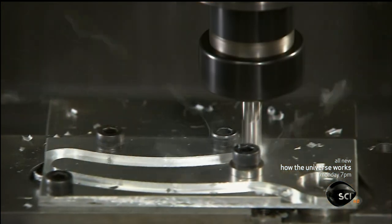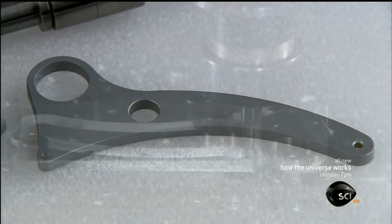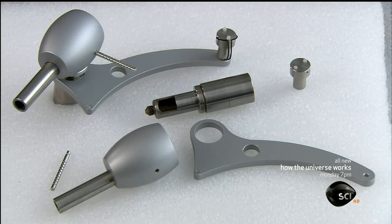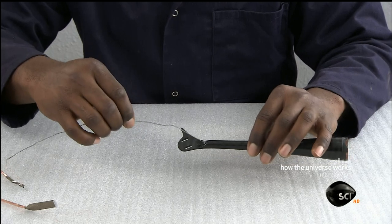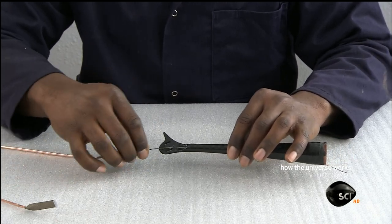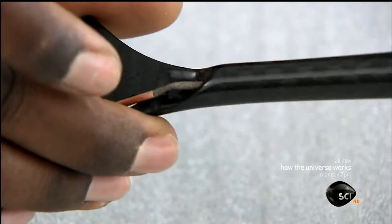Next, the platform for the tonearm takes shape. It's designed to cradle all the parts at the end of the tonearm, including a cylindrical housing for a spring mechanism and an egg-shaped housing containing a bearing. A technician now assembles the tonearm, beginning with a tapered tube made of carbon fiber — a high-tech composite that's extremely stiff, so there should be no structural weakness in this crucial part.